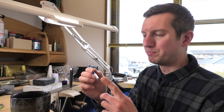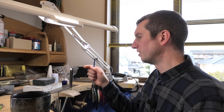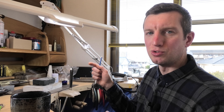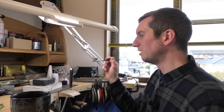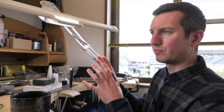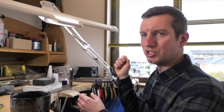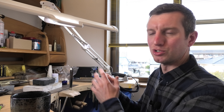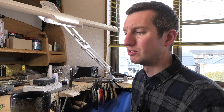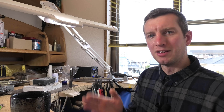Have a bigger than usual brush and keep your water nearby. If you are having trouble getting the solder to flow, or it flowed the wrong way and you've got to put a bit more solder on — that happens — make sure you get the tissue nice and wet again and keep an eye on it. It will hiss as you get heat on the ring and the water will evaporate, so you want to keep the tissue wet. After it's soldered, just let it sit a little bit — don't just grab it and pull the tissue off, because if there is a bit of heat in the stone you don't want to suddenly pull the tissue off and have a cold draught. Just let it sit there and cool down. It's a good technique — I've been using it for 20 years and never had a problem.